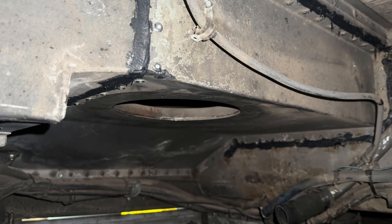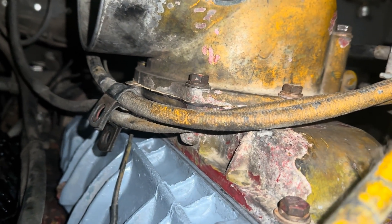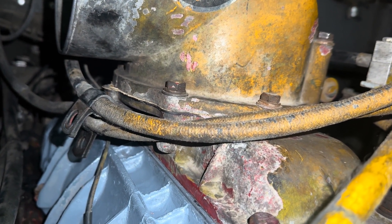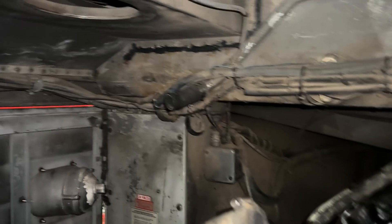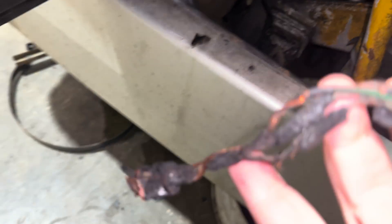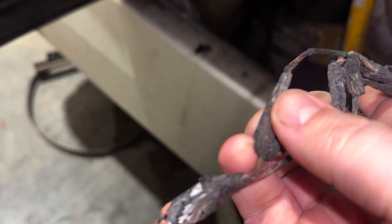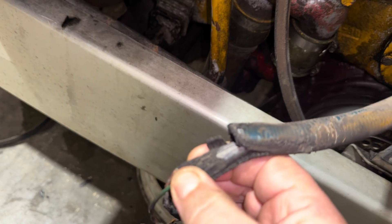It was still going through the air filter and getting filtered, but before, this over here was sucking dirty air in through here. The blower's on, everything's ready to go. We're just finishing up the tune-up and then the valve cover's going back on. We'll have this thing running tomorrow. We got the new block warmer put in — that's all installed. But the block warmer wire is all melted, bare wire — that's 110 volts. I don't know how far back it goes that it might be shorted out. It's just like a piece of Romex or something.